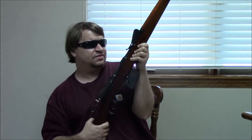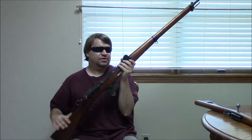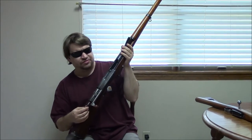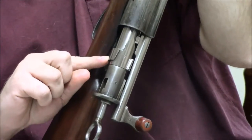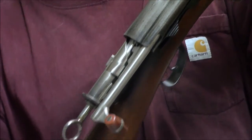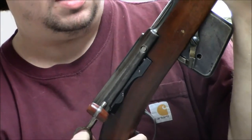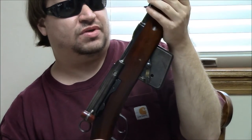This was the front-line infantry weapon in Switzerland for a time, but it has an interesting story. Even before these were adopted, many in the military were concerned that the straight-pull system wasn't strong enough. The locking lugs here are towards the rear of the bolt, which means they lock up towards the rear of the receiver. Many were concerned this wasn't strong enough, and they actually asked Schmidt to redesign it, moving the lugs forward to strengthen it.